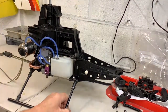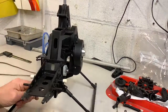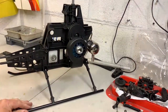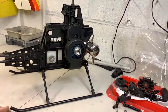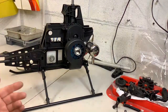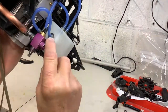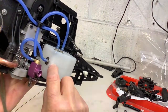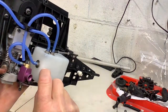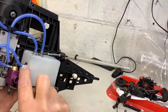The other thing I did is I put a new bit of tube on the clunk, and I cleaned the clunk up, because when they go green with old fuel, it had all funny colours. I think the clunk is actually brass, I don't know. It's a real strange way of doing this, because if you look at where that goes in, I've put a big washer behind there, and behind this, where it goes into the tank, there was a rubber washer. And I thought, well, how do I get all this out of here? Because the hole was just the thread size.